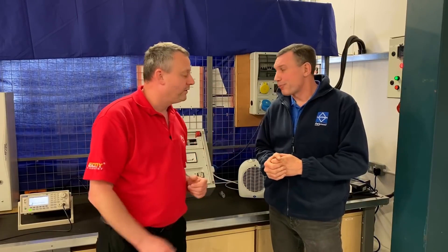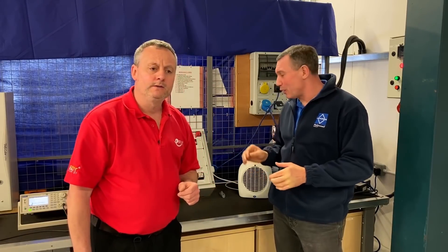The AFDD RCBO offers four levels of protection — it's the ultimate device we've got at the moment. It offers protection against overcurrent by short circuit or thermal overload; residual current protection on pure AC or pulsating DC; protection against arcing faults whether series or parallel arc; and lastly, protection against sustained overvoltage. The device responds to a minimum threshold of 275 volts — when it goes over that it will also trip under those circumstances.